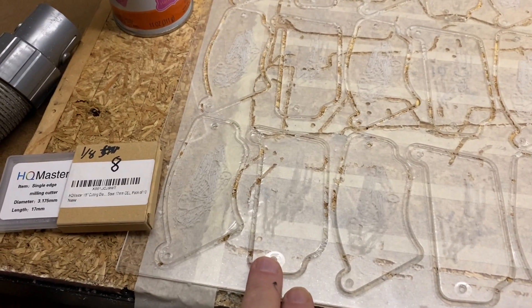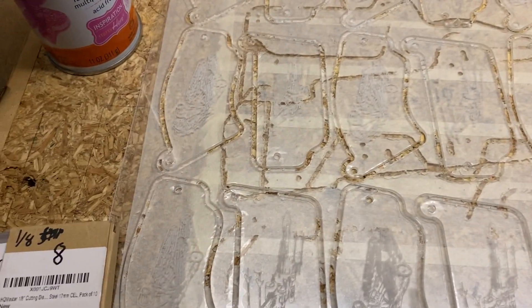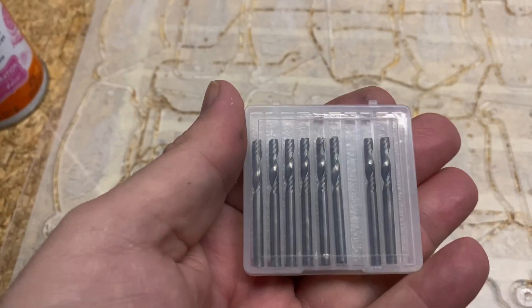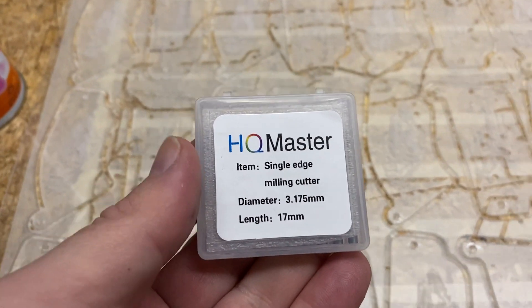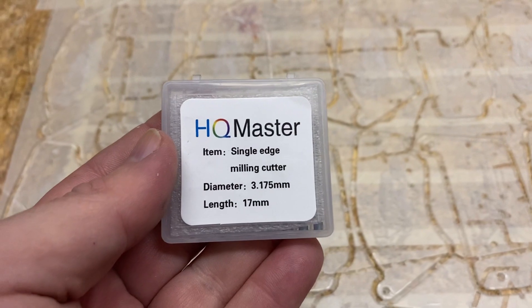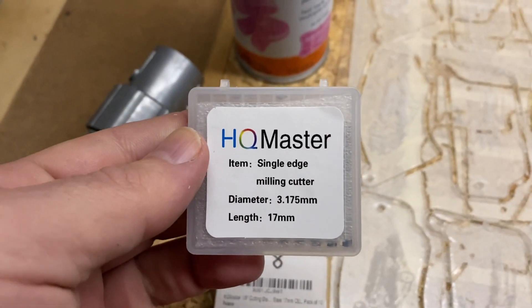I run one path that is just all the holes, so it drills all the holes with the one-eighth inch bit. I used to buy expensive $65 coated ones and I'd have a heart attack when I broke one, but now I get these from Walmart — a little package of 10 bits costs $15. I broke one last night after only about three inches because I had some vibration in the plastic. Just went 'oh well, there goes a buck and a half,' pulled out another one. The link for these will be in the description.